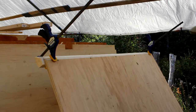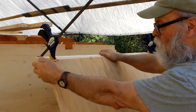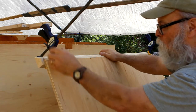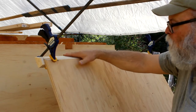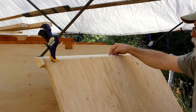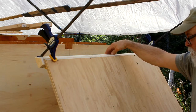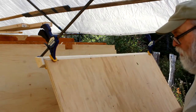The wind's died down a little bit so maybe you can hear me. You can see what I did here — after I cut this bevel, I took a cleat, just a 2x3, ran it through the table saw. I couldn't quite get the angle I needed since the table saw only goes over so far, but I cut it close and edged it up temporarily, clamped it in position. Once this is all glued and set up, I'll go back over it with the plane and sander and match the bevel angle with the transom. I'll cut out a little notch right here to fit the keelson. The keelson goes right to the edge of the transom, and this cleat will help hold it in place. I'll be gluing and screwing it, and when the bottom's on with all the epoxy resin and fiberglass, it's going to be very, very strong.